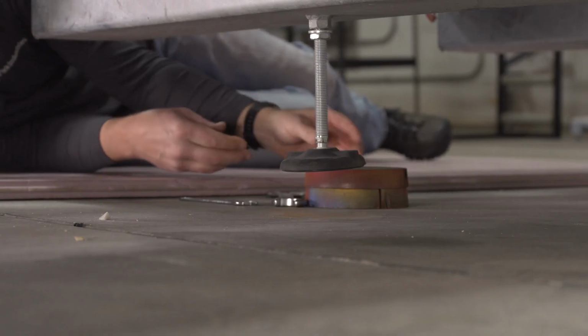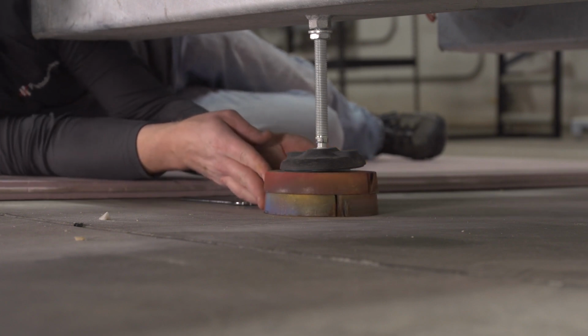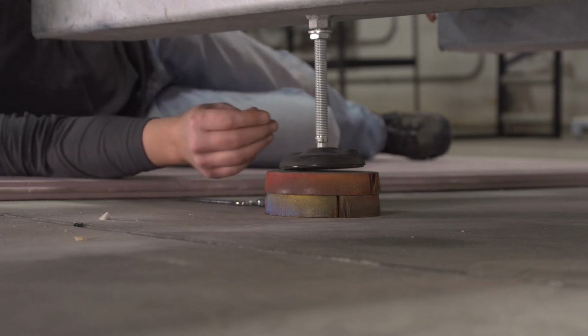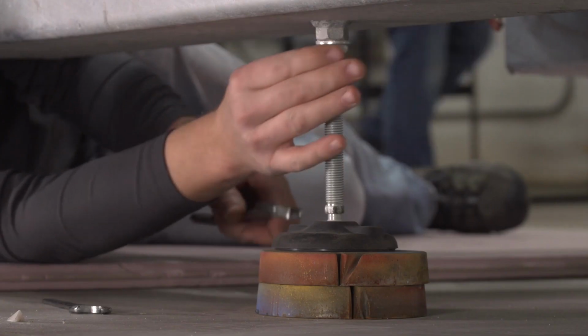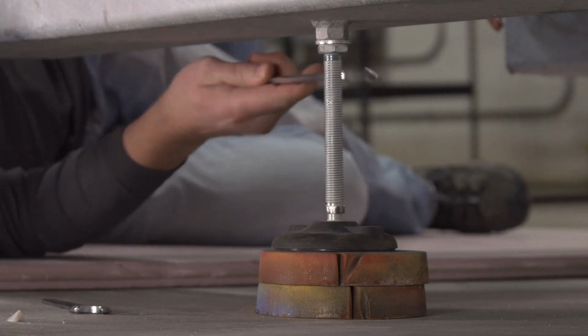After leveling the machine, lower the 2 center feet until they just touch the floor. You'll need to use a shim block here as well if they were used previously when leveling. Once the foot is lowered to the floor, tighten the jam nut up into the fork pocket.